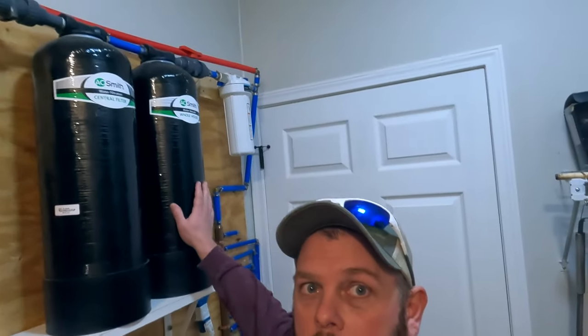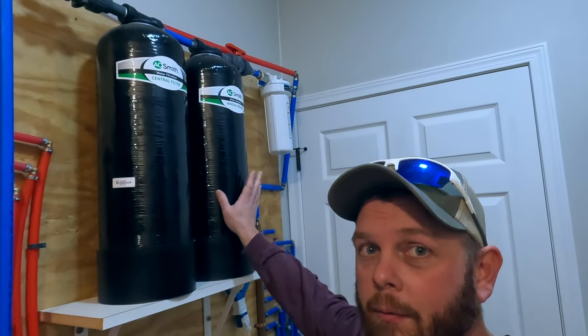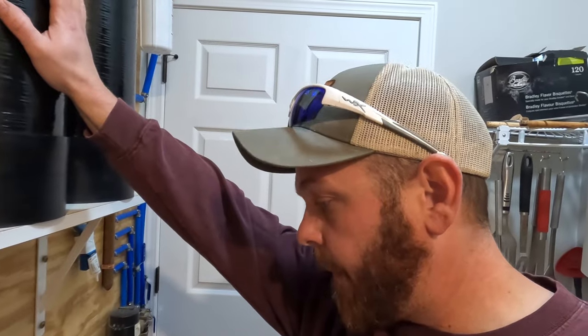This is made by A.O. Smith — you can get the same stuff at Lowe's or labeled differently for a lot more money. I got it all off Amazon. The water comes in through a pre-filter, then up into the first filter which is a descaler — it's got some kind of media that changes the polarity of the water so the sediment won't stick. It doesn't filter any of it out, so all the hard water minerals are still there. Then it goes into a charcoal filter and then a post-filter. Since we put it in, all the faucets are so much better. The chlorine level was huge — the carbon tank pulls a lot of chlorine out of the water. That's been a pretty solid investment.